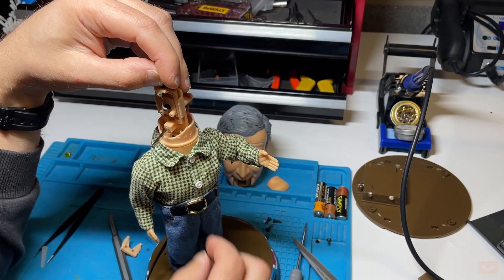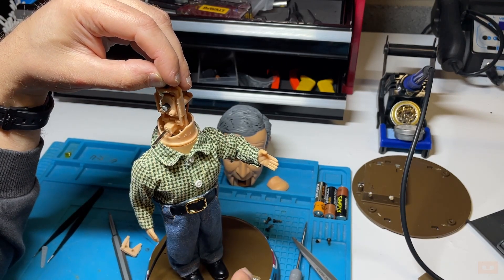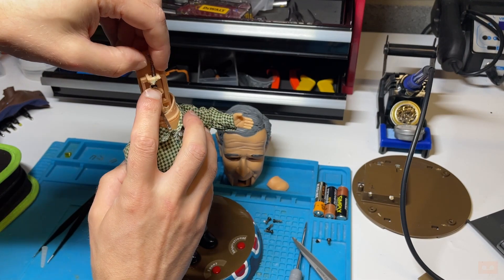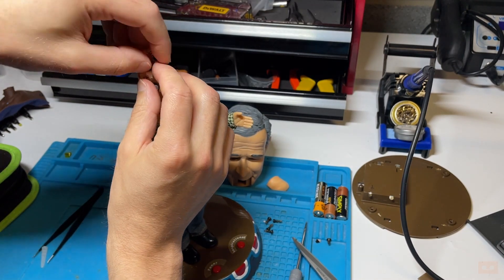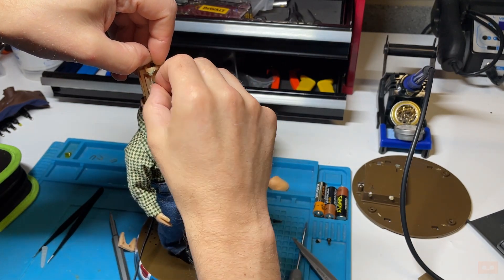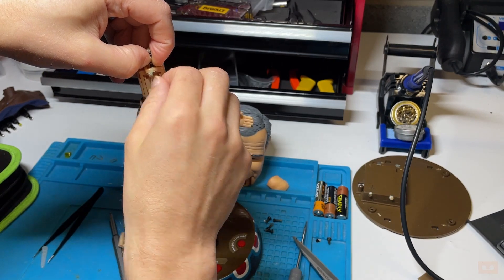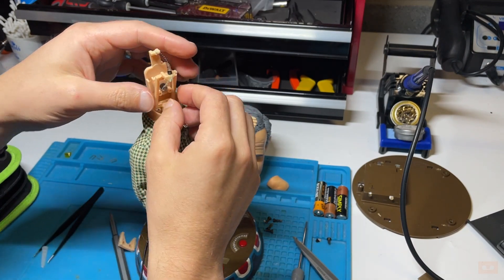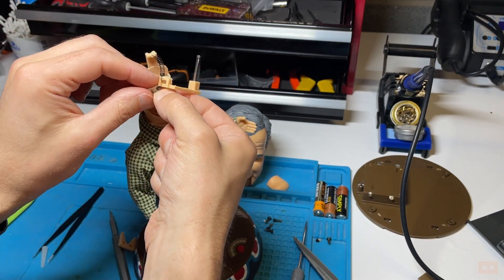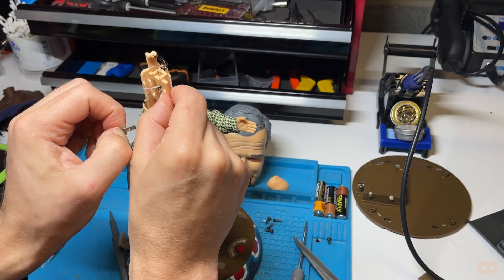Let's try this. More quotes playing. So if this spring was a lot smaller, all the way retracted, then this would pull it down. I think that's what happened - I've really stretched the spring taking it off. So I'm going to need to shorten that spring. Then I'm also going to need to attach the string onto the cog somehow, and repair the cog so it stays attached to the motor and spins. That's where we'll go with that.